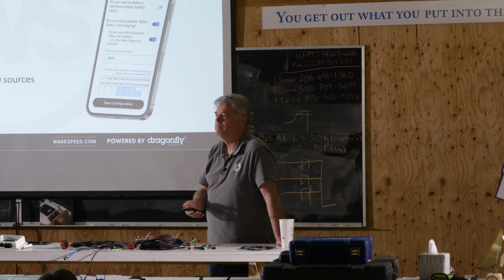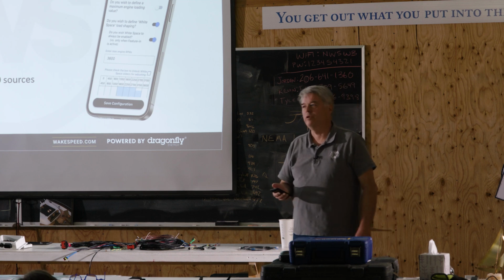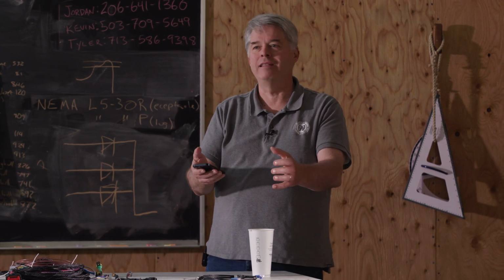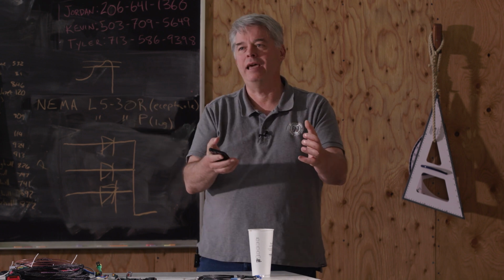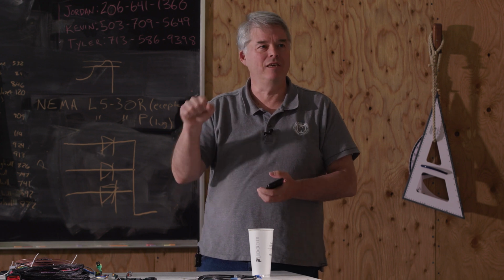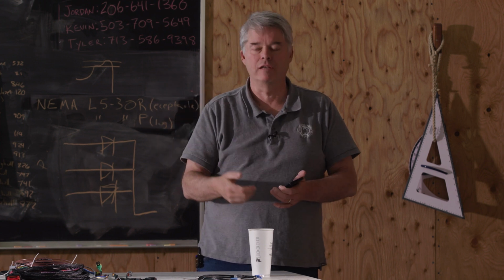We're going to do that right now. This all came about when I first learned about this. Some guy in Sweden had a little one-lunger, 9 horsepower engine for his auxiliary to get in and out. And he put like a 190 amp alternator on it. He couldn't move. He said he put it in gear and advanced the throttle and the engine's RPMs wouldn't come up. It was just so overloaded.